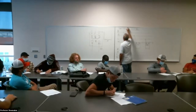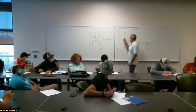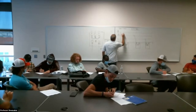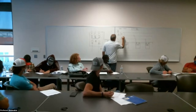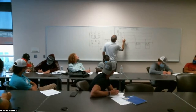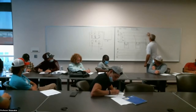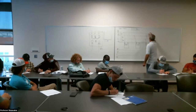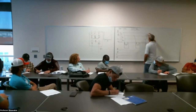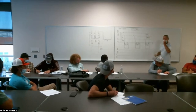What is my primary voltage? 2400, 4160. Draw it in. If we connected the transformers to ABC, A to neutral, 2400. B to neutral, you can guess it. 2400. And C to neutral, 2400. There you go. Now A to B, B to C, A to C. This is phase to phase now. 4160. Now I'm okay with it.